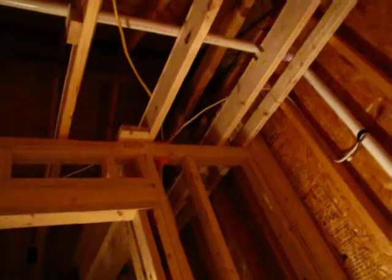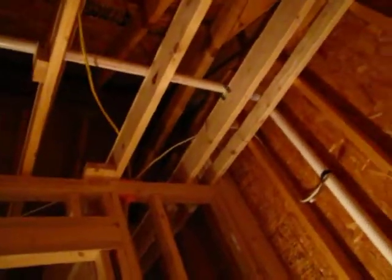I just did my garage, which is 500 square feet, and I used green board for it because it doesn't make sense not to. It's a buck or two more per board, insignificant. With a bathroom I default to tub or shower and always like to make that suggestion, because someone might come in after us and put a shower or tub over there. That's your call, but I would put the floor in first, because we can put the wall there and build up from it.